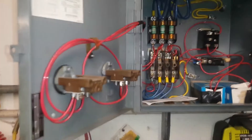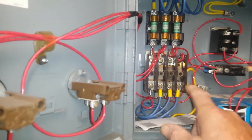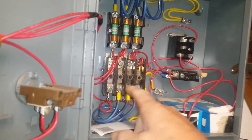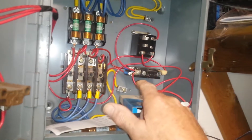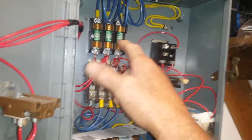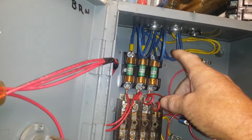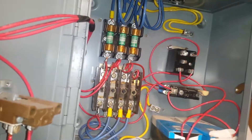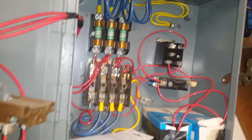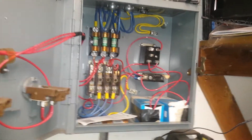As you can see, this is the start, this is the stop. This is a regular three-phase contactor, this is the coil side contactor, this is a dropout relay, this is a heater for the third leg, three fuses. This is where the power comes in, goes through, comes out the bottom, goes to the five-horse idler motor. Capacitors are in here — there are two.